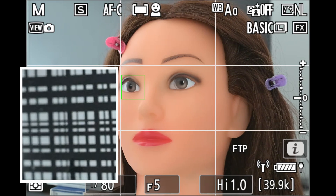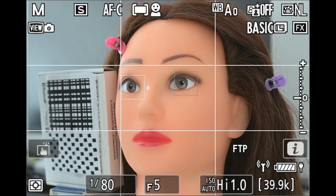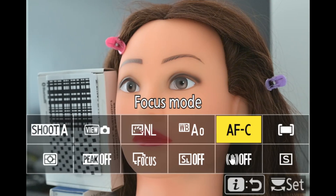These constant adjustments are caused by low-light conditions, which make it difficult for the on-sensor phase-detect autofocus pixels to differentiate subject contrast from noise. To make this even clearer, I'll switch the camera to manual focus so that we can observe the camera's phase detection indication via its on-screen rangefinder.